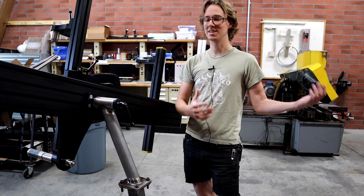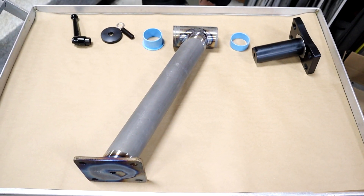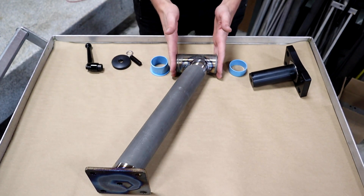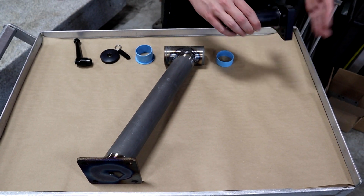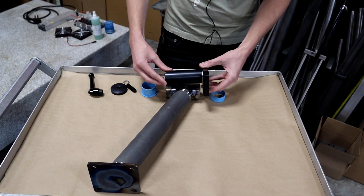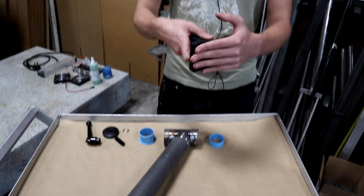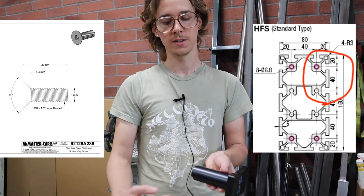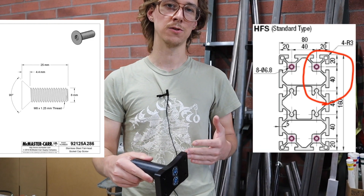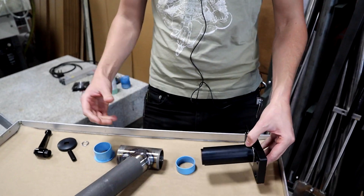Now let me show you how I designed it — the engineering and nifty features. This is the assembly in sort of an exploded view of the bench mount stand. This is our weldment, which will be powder-coated black with masking on the inside and on the faces. This goes against the frame fixture main extrusion — this slides inside of this tube. On the back we have the end caps. This has 40-millimeter spacing for these bolts because the extrusion we're mounting to has T-slots that are 40 millimeters on center. You can pass M8 fasteners through these holes and bolt up to that T-slot extrusion. You could use this for a different style of frame fixture or your own extrusion, but I engineered it for ours.